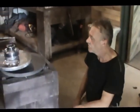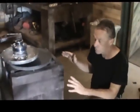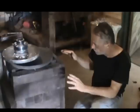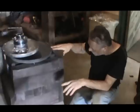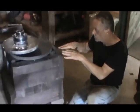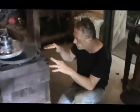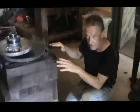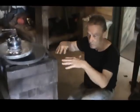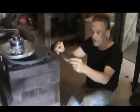Okay, to recap on what we have learned, so down the road if you try this, you won't have to go through the mistakes we did. First of all, on the first pour we had leakage in the babbitt right underneath here. The main reason, I think, is the plate we had was thin to start with, and it was rusty. We should have prepped that plate better and got a smoother surface for the babbitt to adhere to. Also, I believe that plate was so thin that when we heated it, we had somewhat of a warpage, and when the plate bows, it'll break that babbitt seal on the bottom.